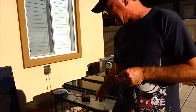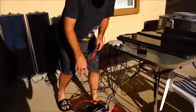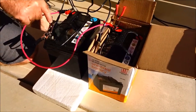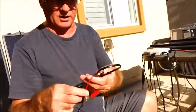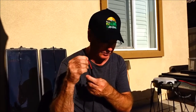He noticed how I had my batteries hooked up to the charge controller and I was doing it wrong. So we're gonna take a look at these batteries and I'll explain it. On these two batteries I have them running in parallel, which means I have the negative hooked up to the negative and the positive hooked up to the positive. The first thing I was told is I had them hooked up with these thin wires, and that was no good — if I draw too many amps out of the battery at a time I was gonna overheat those wires.